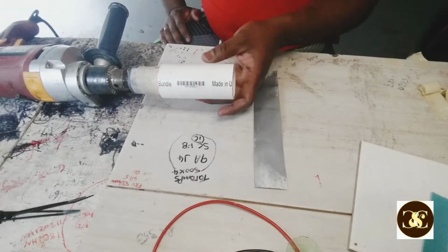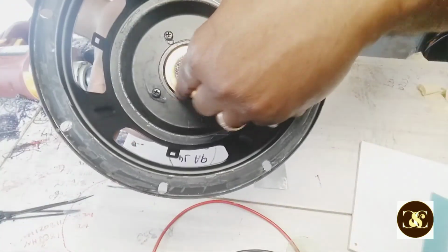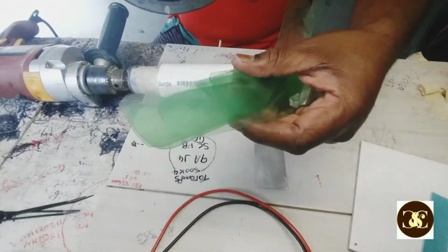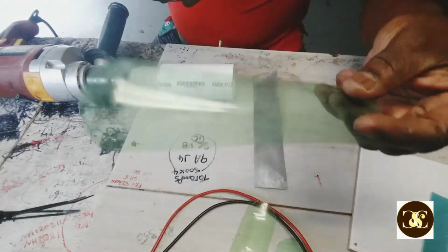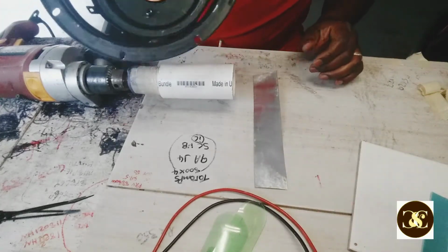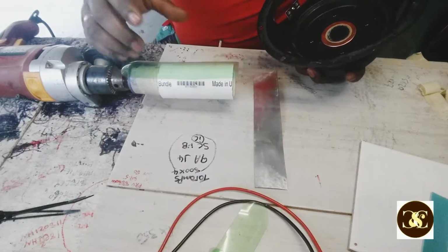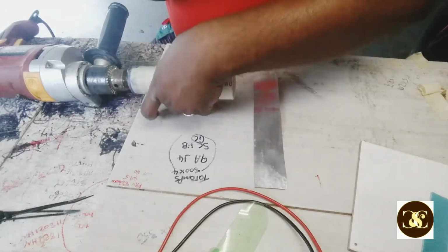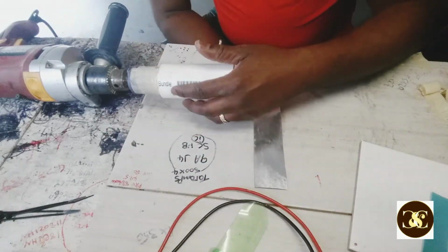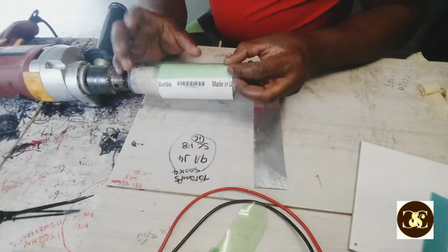I have this piece of pipe that matches the diameter of the voice coil inside here. But I have to put some strips, which I cut from a soda bottle. We call them X-ray strips or shims, whatever you want to call them. You get the diameter of this, and then you put these here so the coil comes off the pipe easier. If you put the epoxy on while you're doing it and it dries, and you want to take the voice coil off, it's gonna make a mess. So when you do that, it's easier to take these off.